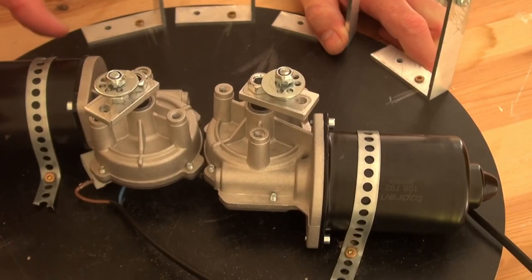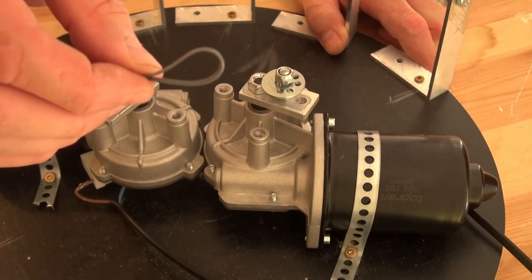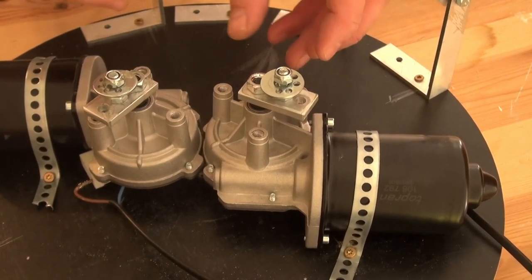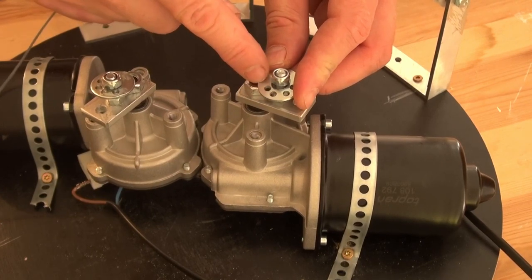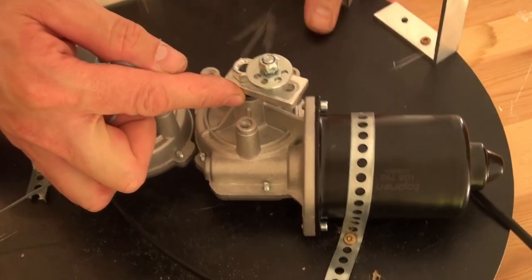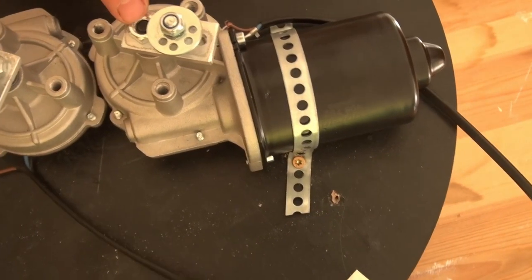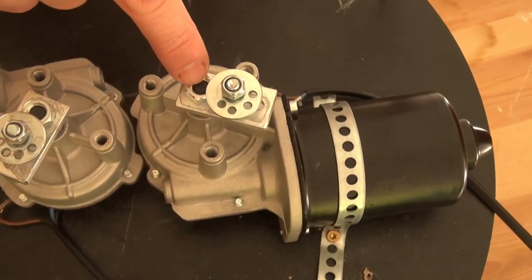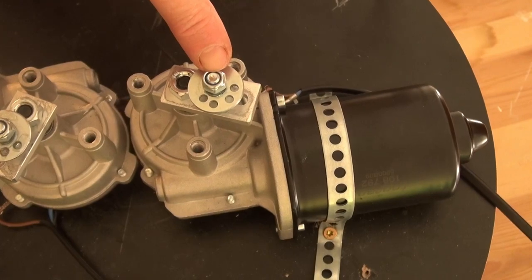So alright, before I add this thing into the cauldron, I will add the pulley, and therefore I use 2 mm fishing line here, and the fishing line is attached to the washers with the holes which I pre-drilled here. And the arms I added to the motor here create a movement of 3 cm in total, so you have 1.5 cm from this point from the motor to this bolt here.